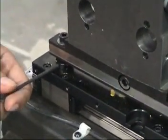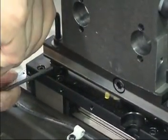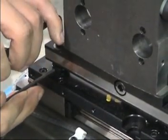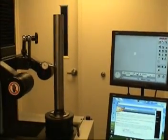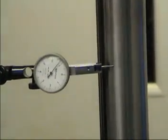Slightly loosen the cap screws. Turn the leveling nuts located under the column base until the indicator reads 0. Tighten the cap screws after adjusting. Recheck front to back tram. Rotate the spindle so the center of the runout is facing the vertical column of the presetter.